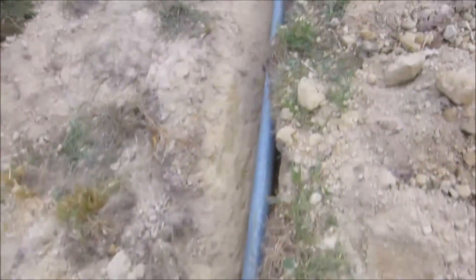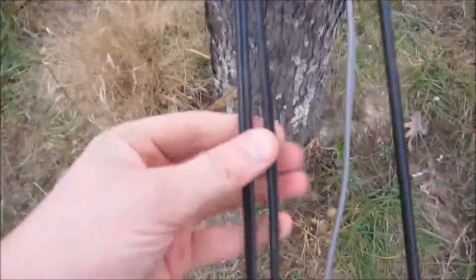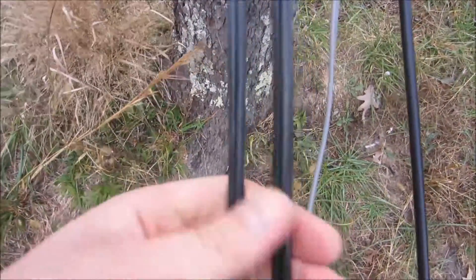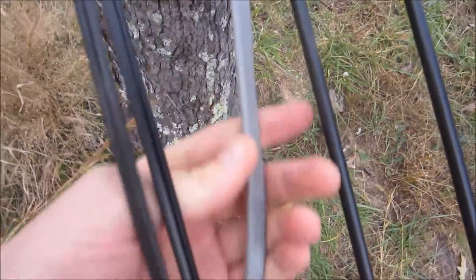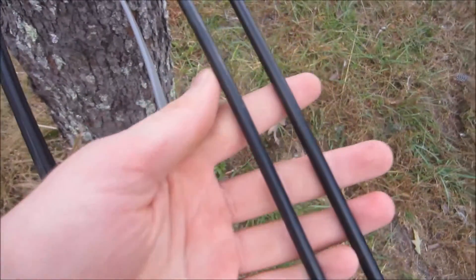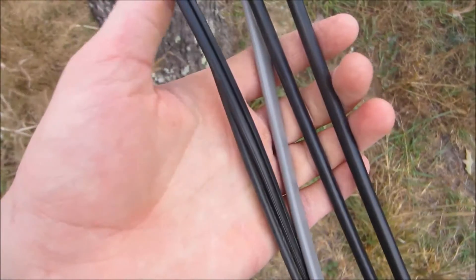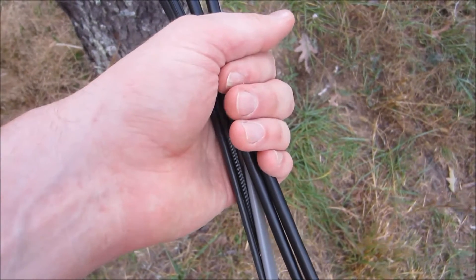You'll note that I stuck those big rocks on top of it — it's an excellent way to get rid of them, because what else are you going to do with all these big rocks? What do I have here? I have two landscaping wires rated at about 200 volts, some 14-2 underground feeder line for the mains, and two gel-filled CAT5E lines. All of these are UF rated and can be used for direct burial. The conduit is really just so that I have a tunnel to add more stuff later on if I need to.